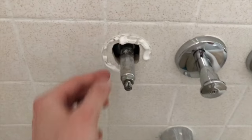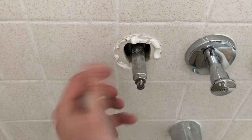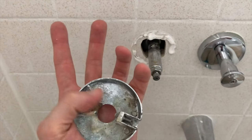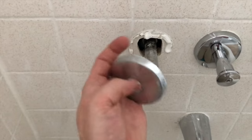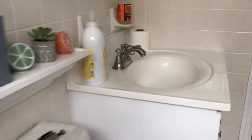Ours came off pretty good and there's no plumber's putty on this at all — it looks like they used caulk. So we are going to remove all that caulk, because when it comes time to re-insert and secure the new plate, we are going to insert plumber's putty to create that watertight seal and not allow any water to get in between the tile and the plate and seep behind the wall.